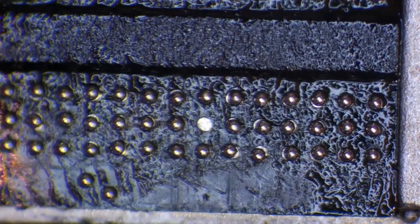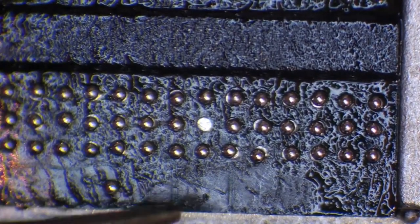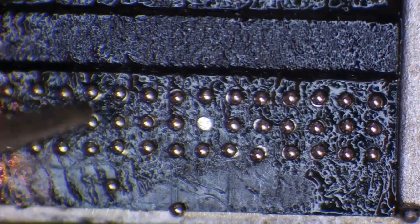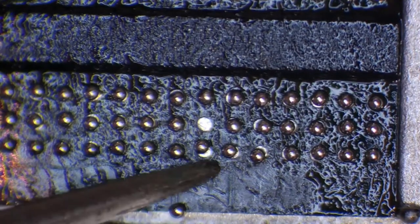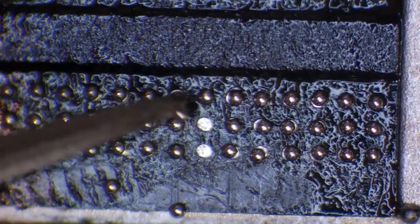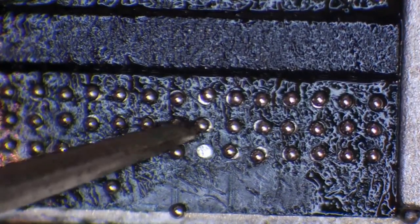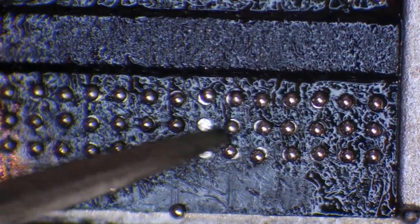All right, so they're in position. If you knock one out of place and it's in the middle of the chip, there are two options. The first option is to just move the other balls up until you get to one that is accessible from the edge. Now obviously, if you have a grid where there's like 10, 15 balls in the way, then that's not really viable.